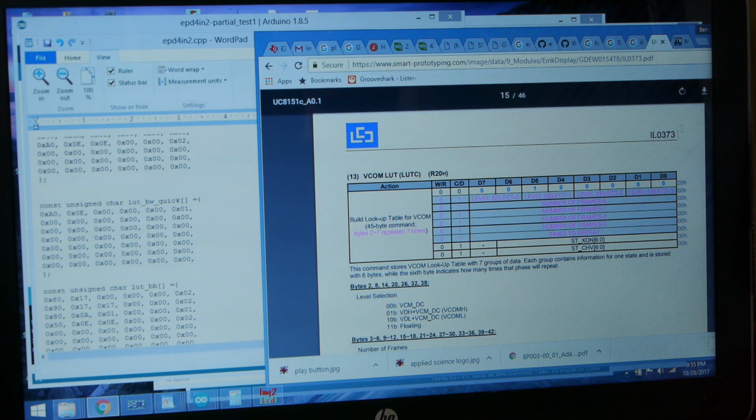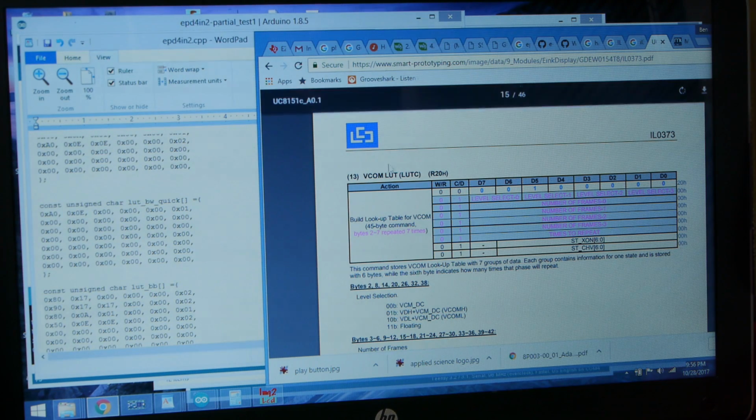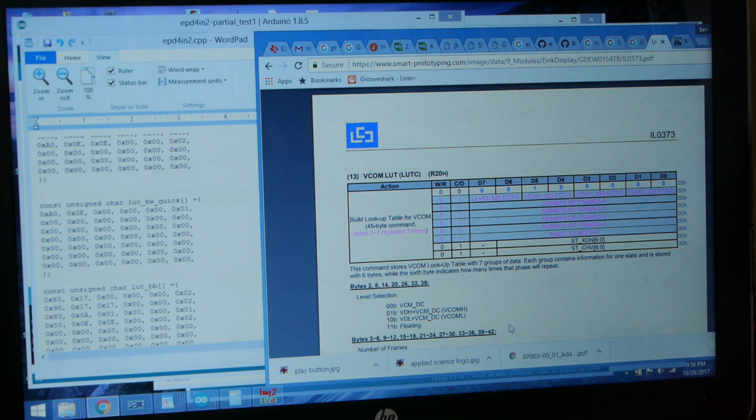But luckily there aren't that many e-paper display controller manufacturers, and they happen to use the same lookup table format in a lot of different displays. However, it's not the same in all of them, so you have to start poking around, with lots of trial and error and whatnot. The tip-off here is that these lookup tables are 42 bytes long, magic 42, and this datasheet spec'd 42 byte lookup tables, so I knew I was on the right track.